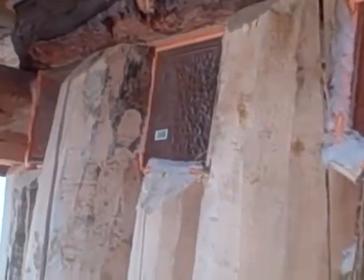This cabin has little glass blocks put in just to allow light to go in. Just cut out the top of the vertical log, slip a glass block in, chink it, you're on your way. Thought I'd show a little bit more of the door. You can see it's just been rough cut with a chainsaw. It's going to be sanded smooth later, but it works now. And the door itself is handmade. The black edge there is actually a piece of angle iron to keep the door straight.